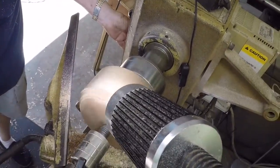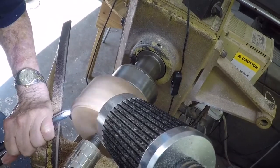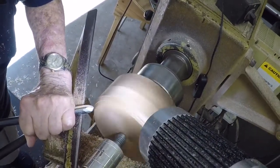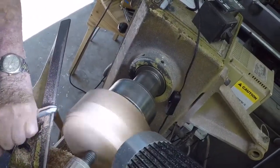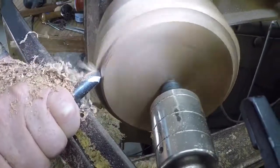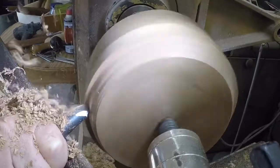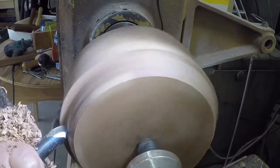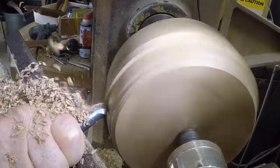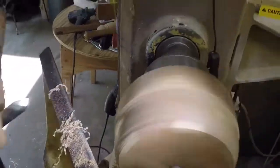What I've done is provided myself a place to put the bevel. I got the bevel on there and I want to face this off out here. I raise my tool handle until I get a cut going, advance the tool, and I roll with my body and take off those bumps. If I'm out here those bumps are hitting me big time — bam, bam, bam. But notice that all that banging you got out here — it ain't there, because I'm riding the bevel. And I'm doing a nice, purdy cut.